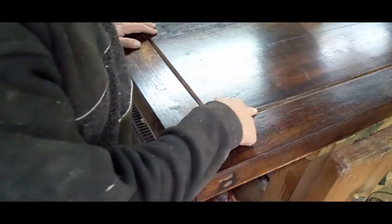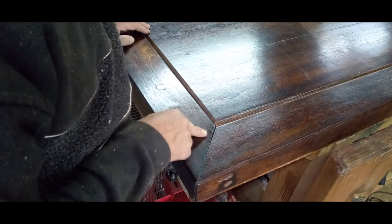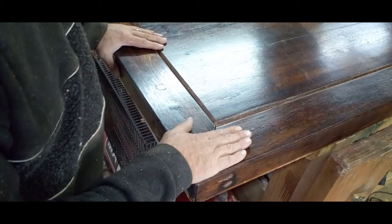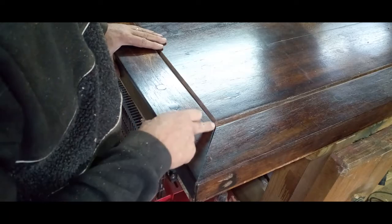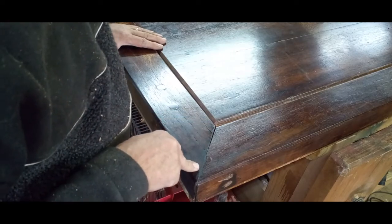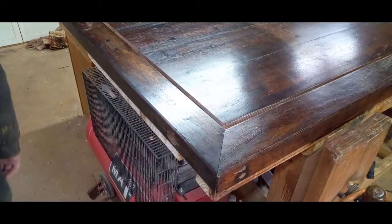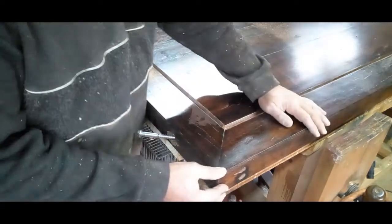After I squared up the table and chopped off most of the filler that was everywhere, our miters are not very nice now. So I want to try to use much less filler than what was in here. I'm going to try and get this one corner closer before I start cutting the miters on the other two ends. I'm just going to remiter this — make this miter a bit longer because it also ended up short. If I can get this to a true 45, it should be much better. Much better miter. After pulling it with massive coach bolts that we're going to put in here to strengthen this, I think we'll close this miter quite nicely.